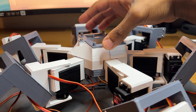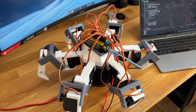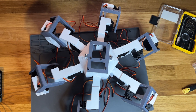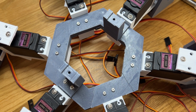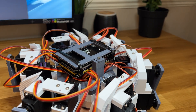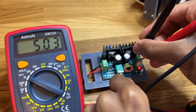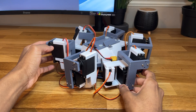To finish off the build, I've made an elevated platform to mount the Arduino on top. Now it's time for testing. First I got all the legs moving randomly, and within a few days I had the hexapod walking — well, sort of. There are two main problems: mounting the Arduino at the top means the cables are left exposed, and I also forgot to factor in where the battery system should go. So I've made mounting posts that attach to the base and allow the Arduino to be placed on the underside of the robot. It's held together using zip ties, but the cables are a lot more manageable. Since I plan on using a 3S LiPo battery for power, I've got a buck converter to step the voltage down to 5 volts, mounted on a new top plate. Here's what the final hexapod looks like — it's turned out a lot better than I expected.